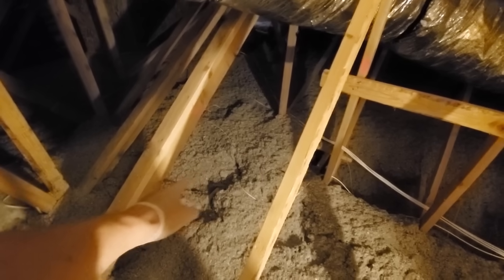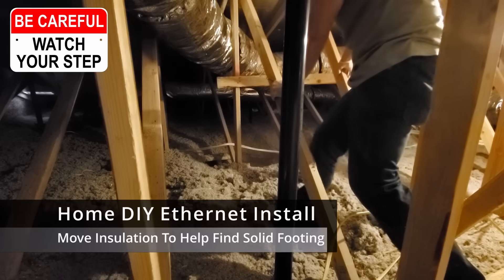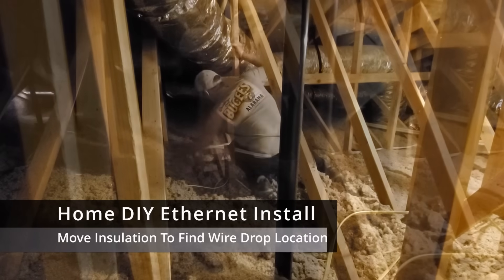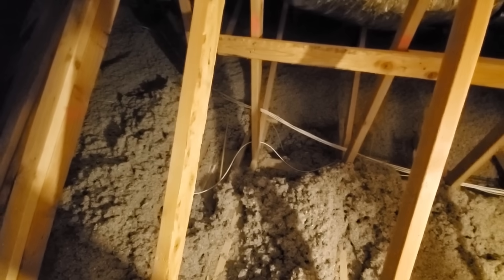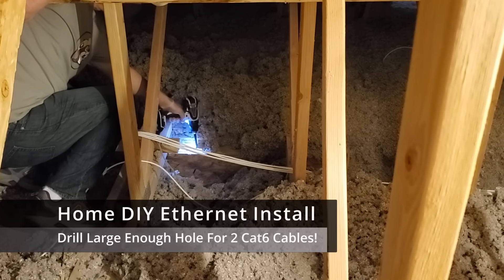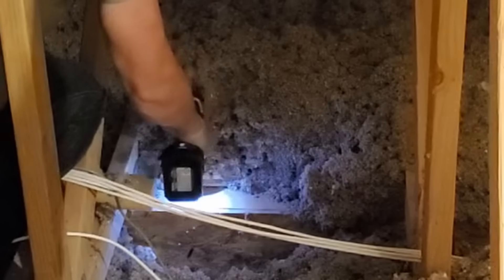I think I've spotted where I'm going to start my drop. The first thing you have to do is move the insulation out of the way so we can see what we're walking on — simply move the insulation to expose the rafters. You're looking for horizontal two-by-fours; you'll be walking on top of those. Once I moved all the insulation out of the way, I can now see the location for the wire drop. Right under the small white wire is the board we're going to be drilling into. You'll need a cordless drill and your largest drill bit. For my situation, I had to drill through two two-by-fours stacked on top of each other. You want to drill all the way through with a big enough hole so you can feed down two Cat6 wires.